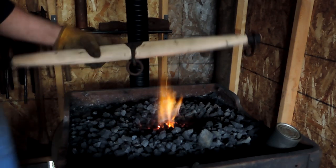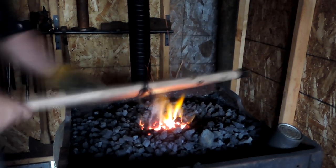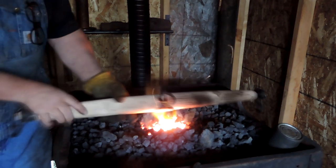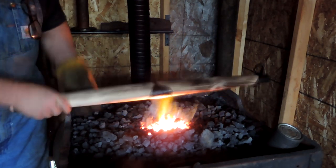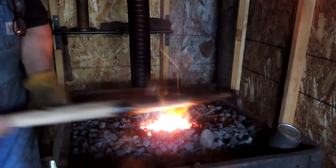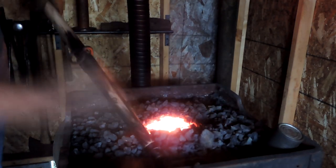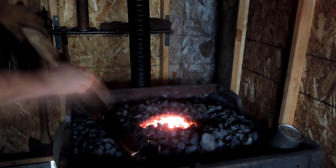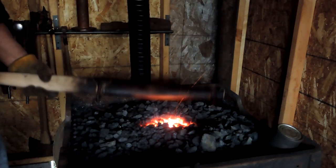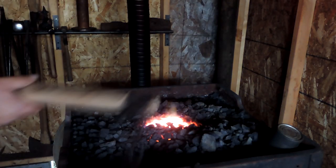I had banked my fire here while I was working on it. That's where you put something flammable down inside and cover it up with coals to keep the fire burning inside while you're doing other things — it's pretty handy. You can come right back, fire the forge back up, and you're not having to restart a fire. So obviously you can see I'm burning the wood on the outside — really what I'm doing is heating the wood and expanding the pores. I'll do one side at a time and then rub that down with beeswax, which melts onto the wood because of the heat, and that beeswax will sink in and protect the wood from dry rot and that sort of decay.